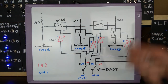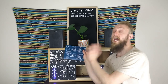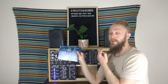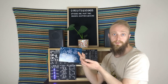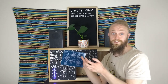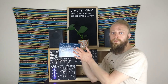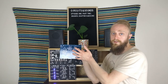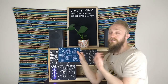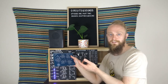Designing the TTO PCB was an absolute monster - I think it took 2-3 months from start to finish. There was just no way I was going to use prototyping board or strip board - I mean I could have, but it would have looked terrible and been sketchy as all hell. I want to use a couple more of these boards for ideas I have in mind. I'm thinking I might change a couple of the integrator cap values to make a triple toasted LFO, or even have the values scaled - so 0.001µF, 0.01µF, 0.1µF, you get the idea.